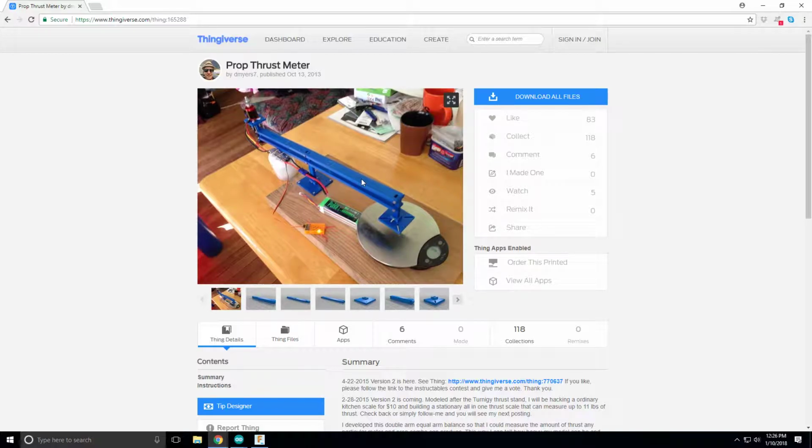As you see, this guy's 3D printed, and this guy has a huge moment arm on here. So that's not going to be what we're going to use, because right here on the Trinus, I only have a 5x5 print area. So this guy has got to be very tight and very compact. That's basically one of our restrictions to design around, this 5 inch by 5 inch platen on the 3D printer. So one thing that we have to look into is that this distance and this distance are the exact same.